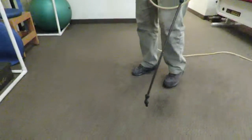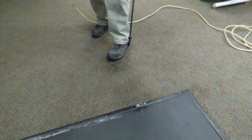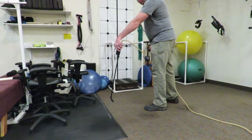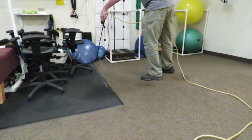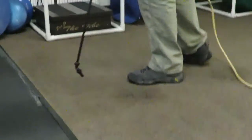One of the things to do is to really know which way you're pointing your tip, because it's a cone-shaped tip. Let's say I didn't want to get this wet at all. If I held it like this and sprayed, it's going to get wet, just like a wall would or a couch or whatever. So to avoid that, I'm going to want to take, and so you can see the way I kind of move my arm, and you see how the tip changes direction. That way when I spray, it's not going to hit that surface. Okay? So that's the idea. You see how close I have the tip to that surface, but it's not getting wet. You can tell because that's dry carpet there. Okay? Same thing works with walls.